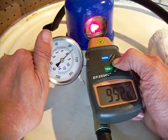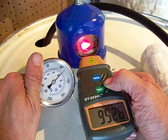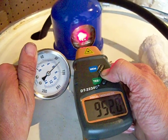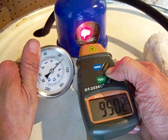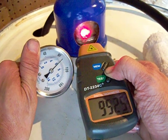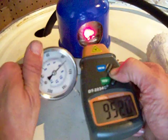The RPM correlates into higher G-force, separating the contaminants to the outside of the rotor wall. This is kind of what we tell people to run at — right around 85 to 90 psi. I hope this helps you. Again, we're PA Biodiesel Supply. Thank you.